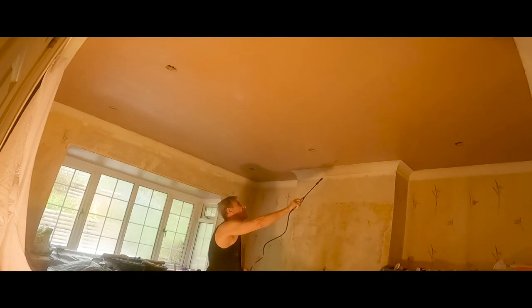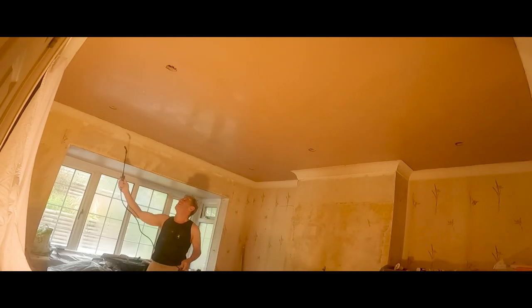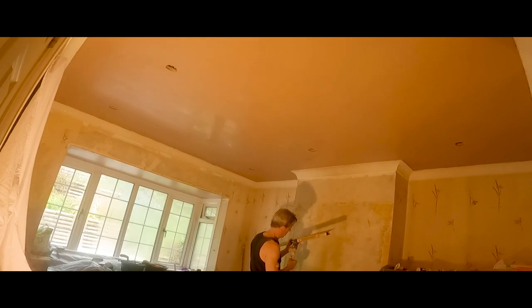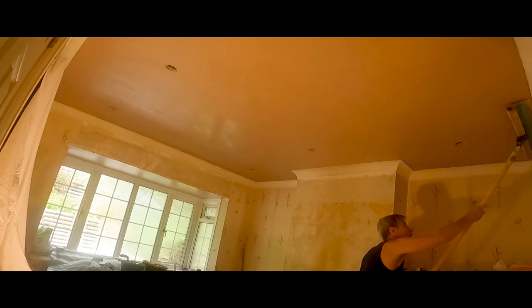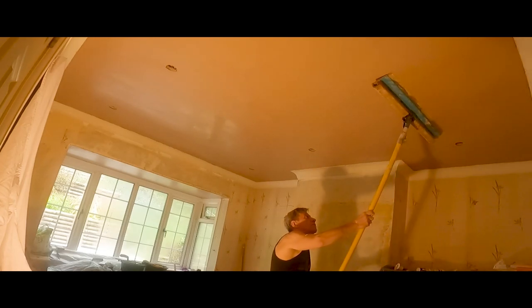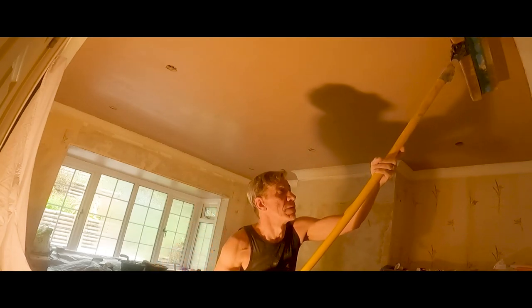Here I'm spraying again with a large pump sprayer. I used to use the smaller one, but if you get a larger spray like this one you can basically coat the whole ceiling with a nice film of water for troweling — the small ones don't really accommodate doing that. So that's my reason for using the larger spray bottle. Now at this stage, with the water up there, this is my metal bladed speed skim. If you use a metal bladed speed skim on the earlier first coat and use it too soon, it will draw the water to the surface and you get a huge chance of blistering. Whereas at this stage with a metal blade, it's just what you want.